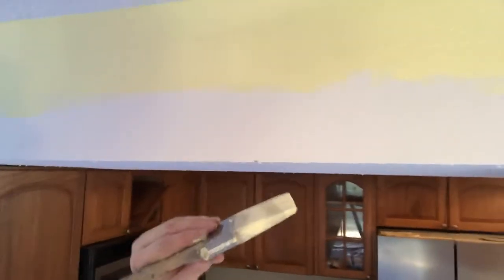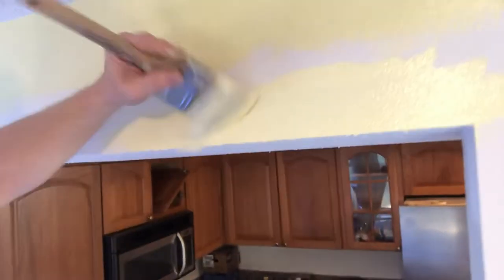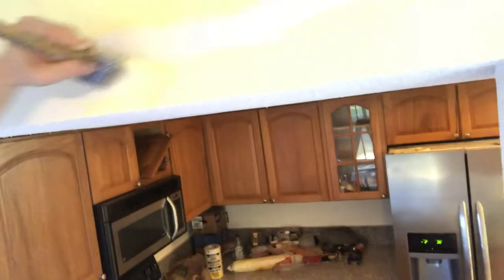Watch this. So here we are — you're up here with me. That's how much paint is on here. I don't want you to go anywhere near the edge in terms of where your hand is. Hold your brush up here, start up here. Watch this now. You can't get paint on the other side of the soffit — it just won't happen. Just keep going back and forth. Your brush is prevented from actually touching the ceiling side of this edge.